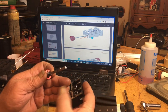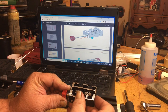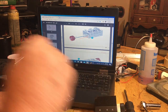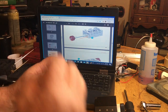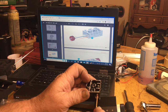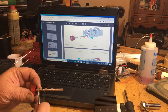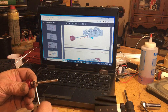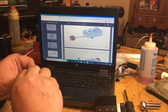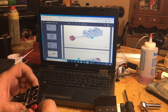And so we'll put it in like so. Camshaft goes this way. Now let's get some grease out here because we don't want to tear the seal. We'll put a little lube in there, a little lube on the seal itself with the bearing, like so. Throw in our camshaft,